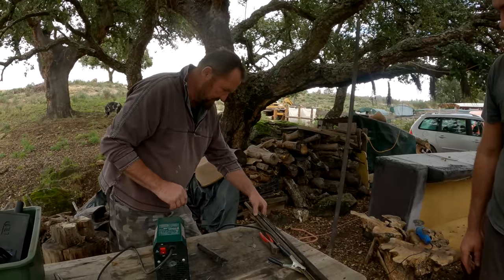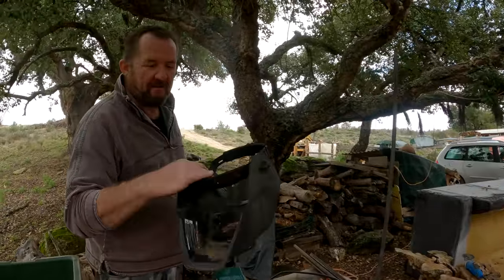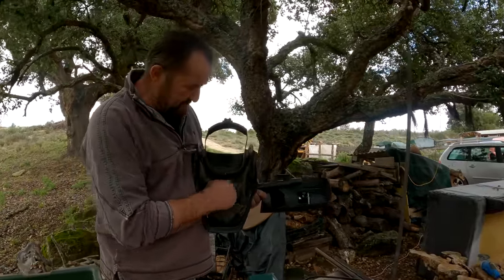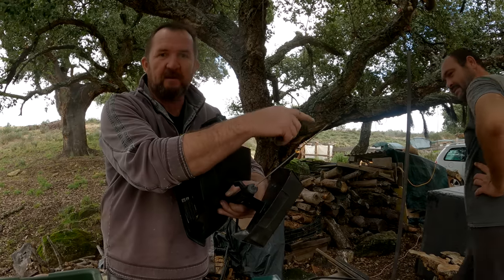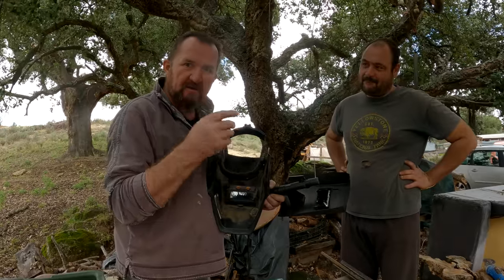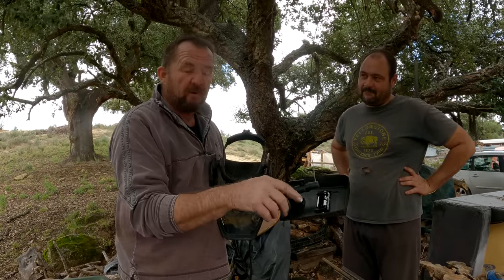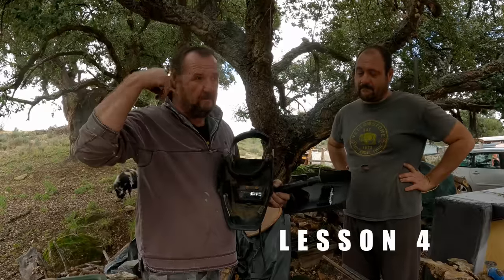Really appreciated if that helps. No worries. Okay, so these welding masks have batteries in them, and they detect in milliseconds the flash of bright light that comes from the weld, and it turns the shade darker, so you can look at the weld, because if you look at the weld with open eyes, it'll burn your retina. Yeah, really badly.